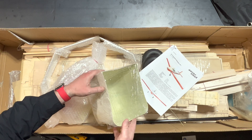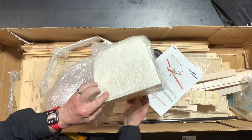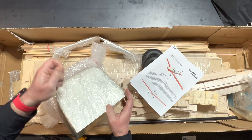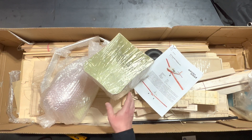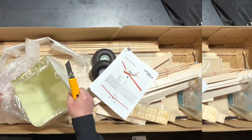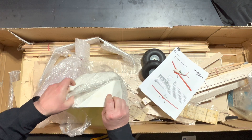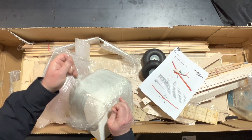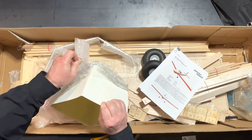Let's start with our biggest part — this is our cowling. As you can see, it's wrapped quite well, and much like the full-size Volksplane, it's almost like just a giant cube, wrapped in some plastic. It's fiberglass, looks great, very nicely done. It's a white gel coat on the outside, which is always really nice — it makes painting and prepping the fiberglass that much easier because it's just that much less prep that you actually need to do.